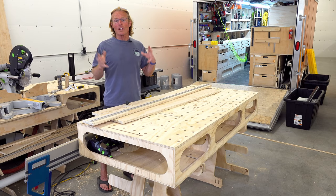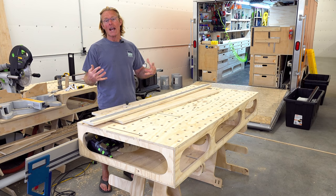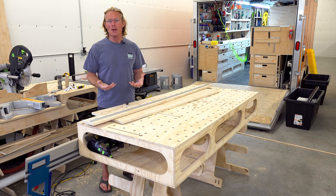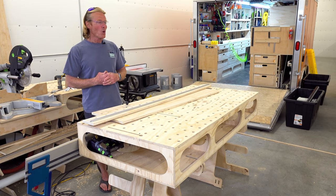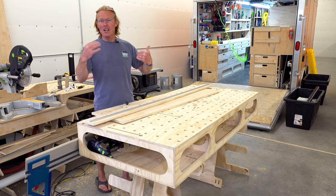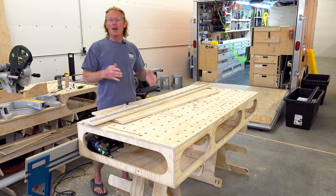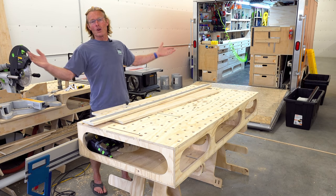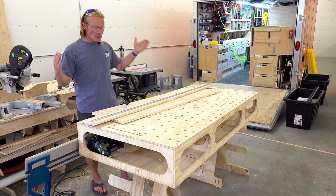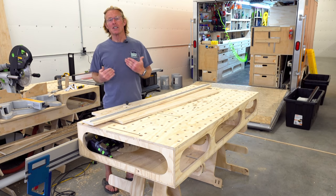When I'm working on a project, I need to break down plywood a lot, and I need it to be accurate and repeatable. When I'm building kitchen cabinets or bathroom cabinets, I need the sides, bottoms, and tops — everything to be the same width and length. If I'm doing 20 uppers, I need 40 sides and I want them all the exact same width and the exact same length. To do that, I need to rip the plywood and then cross cut the plywood.